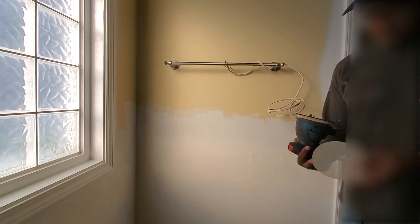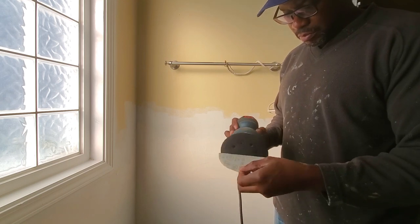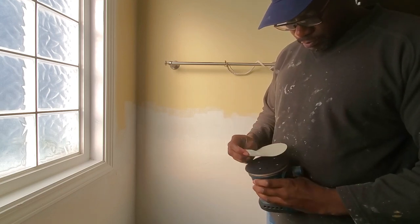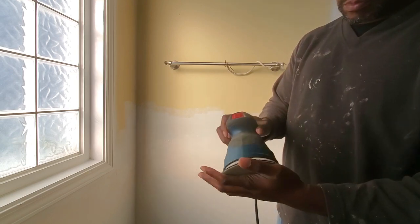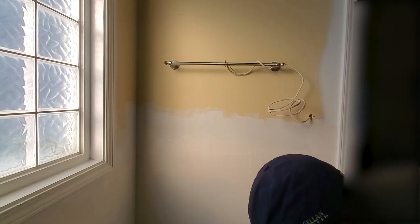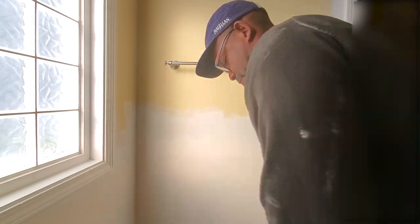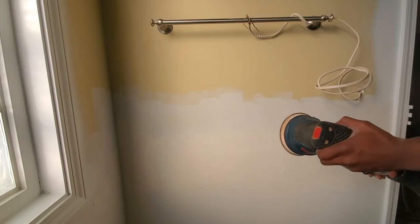Here's one of those screens — you just place it right over the pad. These are different from paper pads; the paper ones have holes you've got to line up with corresponding holes in the orbital sander pad, whereas these you just place right over and you're ready to go. Always remember to turn on both your vacuum and your sander — both machines make so much noise that it's easy to forget one and defeat the whole purpose.